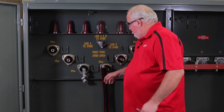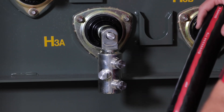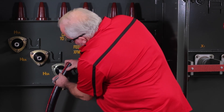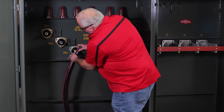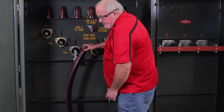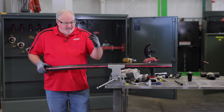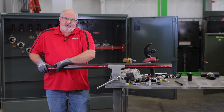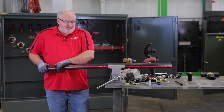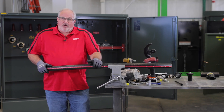So the way we're going to work this is we put our cable up here, line the cable up. Then from the cable, we're going to mark the center of our bushing on the cable. Then we're going to go from there down 14 and three-quarter inches to start our assembly process. When you're making up your T-bodies, it's super important to always make sure that you have your cable as straight as possible. Always start with your cuts as straight as possible — that's going to make your assembly and prep time a whole lot easier.